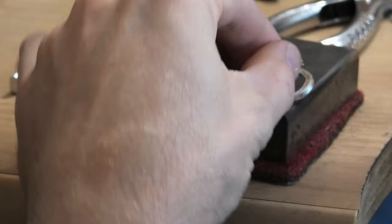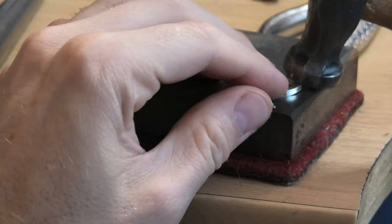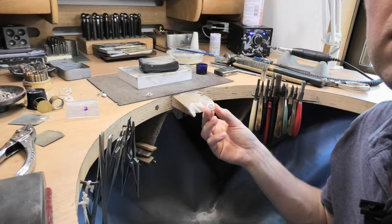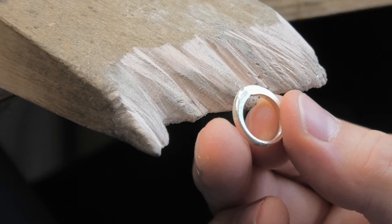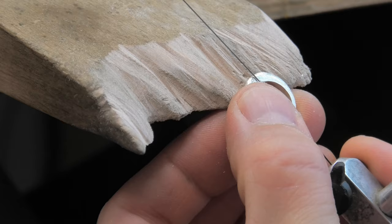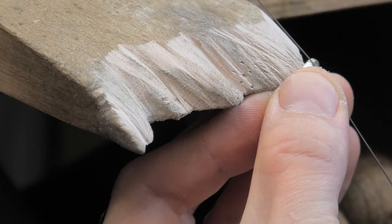Tapping the shank up to a tapered point gives me an extra bit of height — also a bit of a design flair. Let me show you a close-up: basically I filed up a shank and I know it looks tiny, but don't forget I'm about to cut that open and open it right up. I'm going to cut straight through my solder join, chop it back a little bit, because that inner join either side is a bit horrible, then make any adjustments needed after.